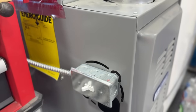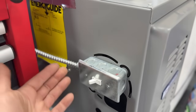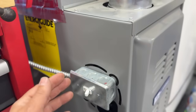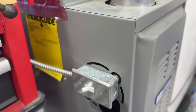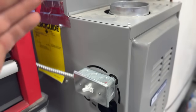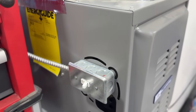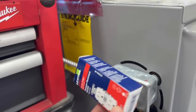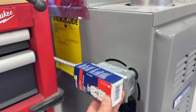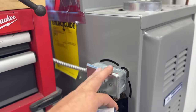When you go to your gas furnace — whether it's in the attic, the basement, wherever it's located — you will likely find a simple switch like this. This is designed so that HVAC technicians can work on the unit and in an emergency they can turn it off. But you cannot get power to this because there's no way to plug anything in, and that's where installing an outlet comes in handy. We're basically going to replace this switch with an outlet and then wire a pigtail to the gas furnace — effectively acting just like this fridge right here.